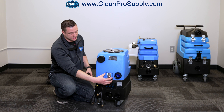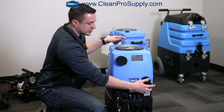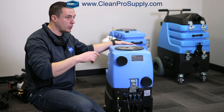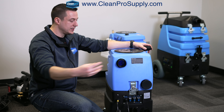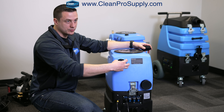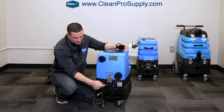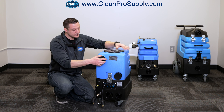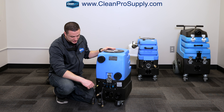What that's going to do is suck the water out of the waste tank and bring it back to your portable extractor. On the flip side, if you want the vacuum going back to your portable extractor but you don't want the water going back as well, then you're actually going to take your vacuum hose from your portable and attach it to this top port. That way all it's doing is adding vacuum boost to your inline setup, but the wastewater is still going to come out of your pump out if you're using this port for your vacuum. If you're not using a portable extractor and you're using it as a standalone, keep both of those capped.